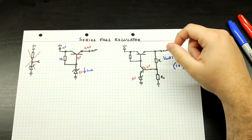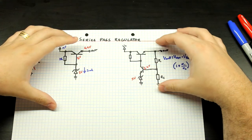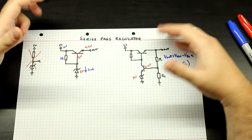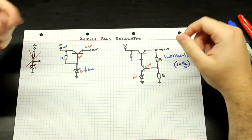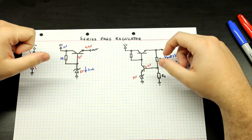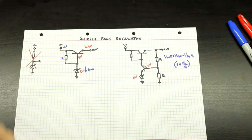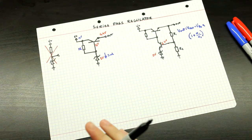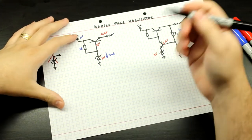It's not as common as before because of the advent of things like the LM317 and all those ICs becoming extremely cheap. But this is still a good circuit to know about, and you can easily design this into any project that you have. Just keep in mind it doesn't have very good regulation. One of the ways that we can improve this greatly is to use an op-amp, so that's what we are going to be looking at right now.